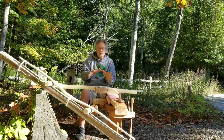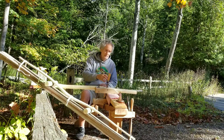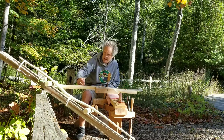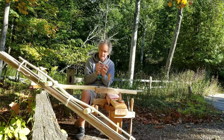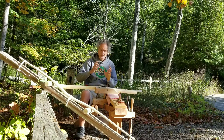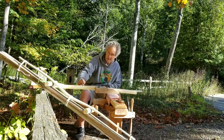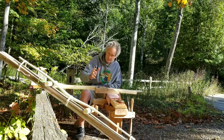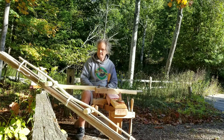But you will retain the maximum yield in that log by doing that and letting it go through a primary drying process with just a line down here. That'll stabilize it, it'll keep it from twisting, it'll keep all those staves from being ruined. I've seen it. Ambitiously go splitting a round into a bunch of staves, they dry, they're all ruined. I would rather spend a little bit more time waiting for those to dry stably, supported by its own self, and then have a full yield.